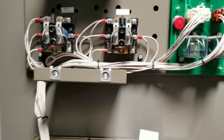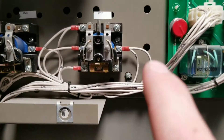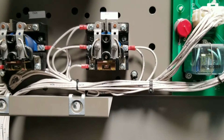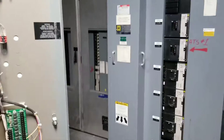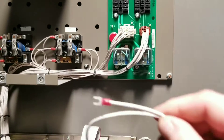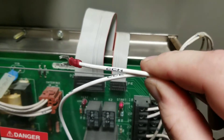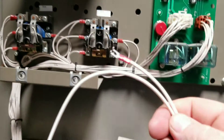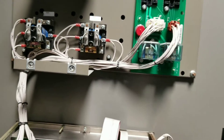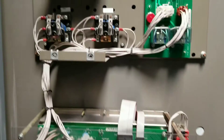This is the most important thing you've got to do on this job because you can mess it up if you do it wrong. There are a couple of wires in here labeled 33 — you have to remove both of them. Then you go to the new harness: you've got CCN and CCE. See how those contactors are labeled? Read the manual and it will tell you exactly where to put these wires. I'll give you a hint — they're on the coil.